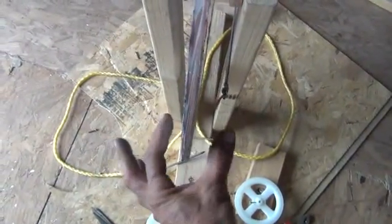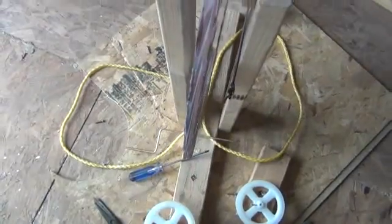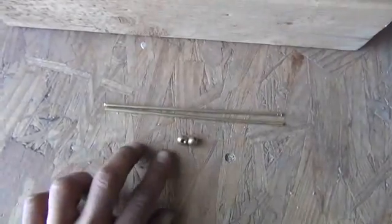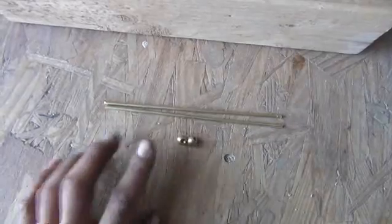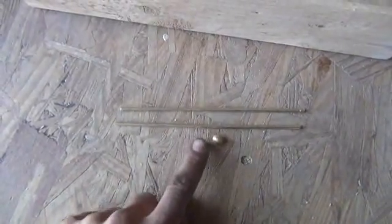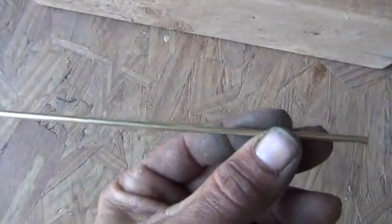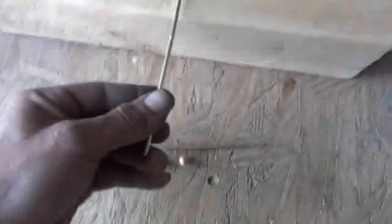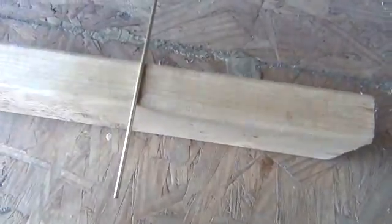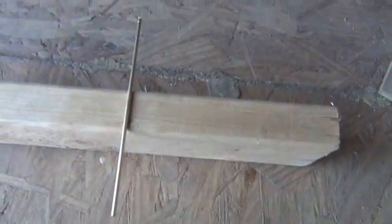Now I'm going to start working on our combs, which will be out of brass or aluminum — I'll check which I like more. They'll be a horseshoe-shaped piece. For the pickups to grab the electrostatic charge generated on the aluminum plates of the rotating discs, I have two small pieces of brass rod and two little brass spheres with threaded screw holes. I've marked the center of each rod and I'll bend them around a 2x4 to create a horseshoe shape, then solder the balls on.